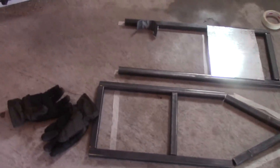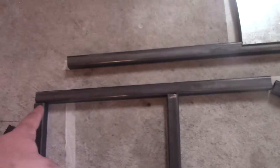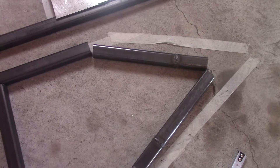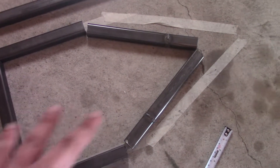So this is the bottom of the bike and this is going to be the top. The cross pieces are 10 inches each, the length from here to here is 20 inches — same on the other side. The angled parts are 9 inches each and I haven't cut the angles yet. The piece from edge to edge is 28 inches on both sides, and this sheet I cut out is 11 by 8 inches.